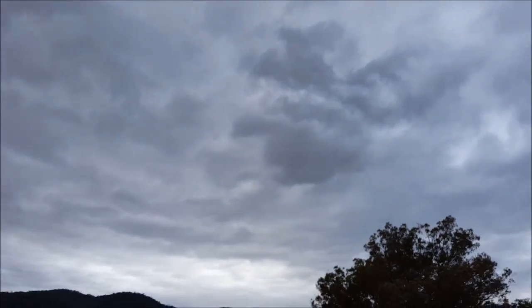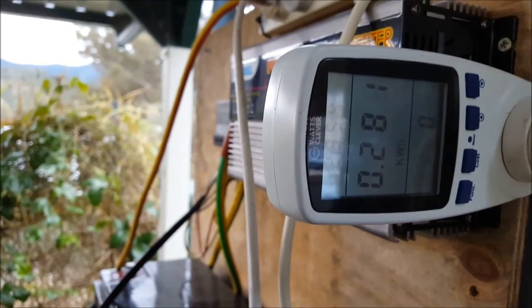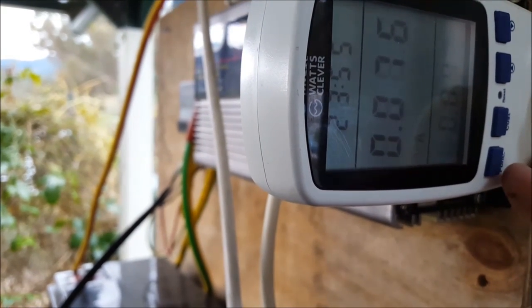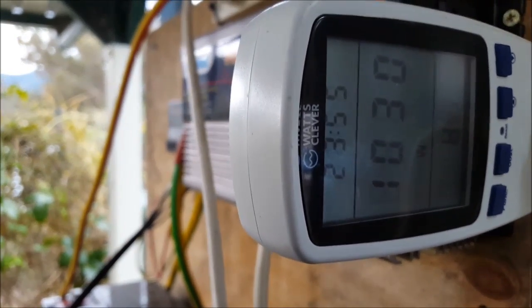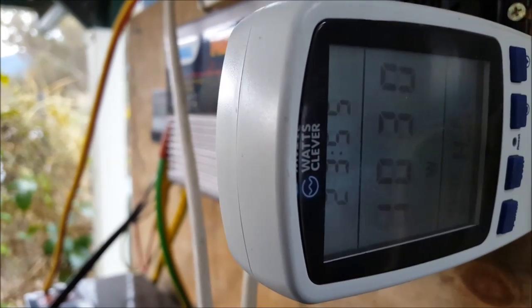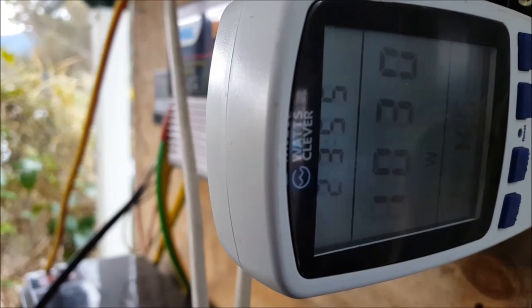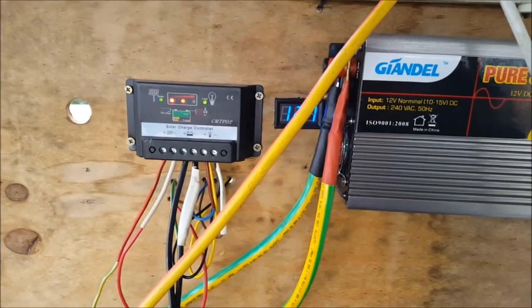This test has been going for 24 hours. In the last half hour it's come over fairly overcast. The batteries are showing 12.7 volts, which I'm happy about. Over here: 0.281 kilowatt hours — 281 watt hours over 23 hours and 55 minutes. Total usage 302 watt hours, low usage of 4 watts, high usage of 1,030 watts. It's a 1,000 watt continuous inverter, so really I should be getting a bigger inverter. That 1,030 watts — I do believe that's from the evaporator coil heater on the fridge freezer, which I've been told draws fairly high current. Anyway, thanks for watching and I'll see you in another video.